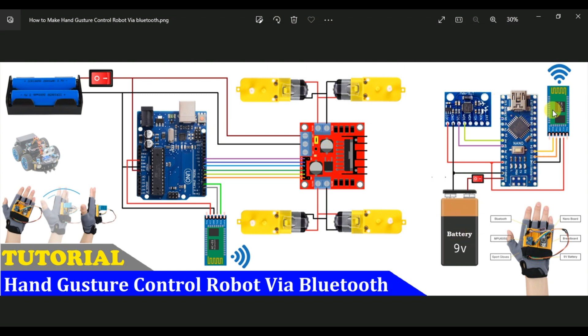Here we have a transmitter. To start with this circuit, we have a power source — a 9V battery. This is an Arduino with A4 and A5. After the Bluetooth module, I have told you that the Bluetooth module pair will need to be one master and one slave. The master will be the transmitter and the other will be the receiver.